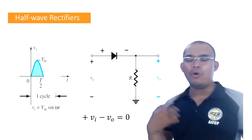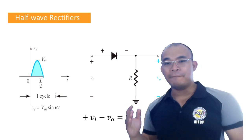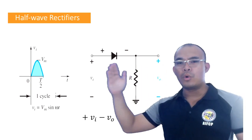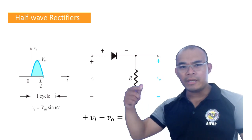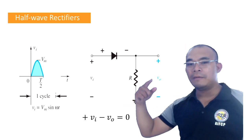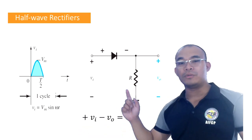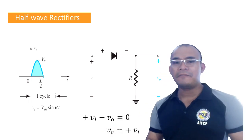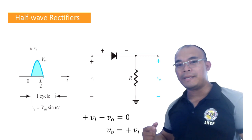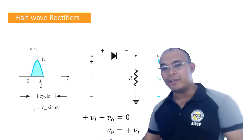So now: positive going out here, and then — take note from Electro 1 — the voltage across parallel loads is the same. So in this particular case, the voltage across your resistor load, your VO here, is only one voltage. Going around the loop: plus VI minus VO equals zero. So if we simplify, the output voltage VO — rearranging — gives us VI is equal to VO, or we can express this as VO is equal to VI.